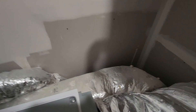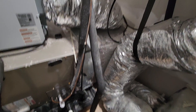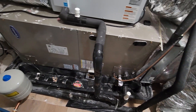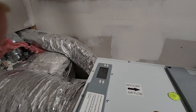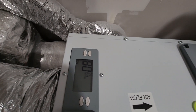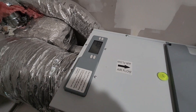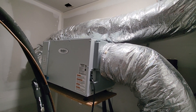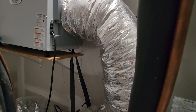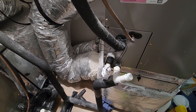It cycles back through the unit, comes back up, gets picked up, and returns. Currently the unit is set at 80% RH so it doesn't continue to run, but it's picking up a high RH reading from inside the unit. This is a second unit — it's an E80 — and it has a longer run with the same configuration, but a much longer run to the return.